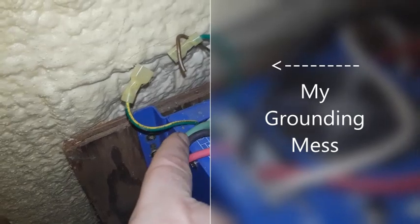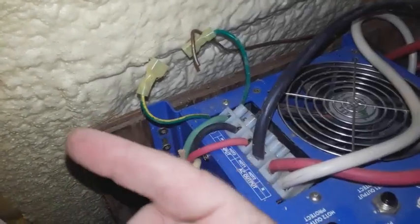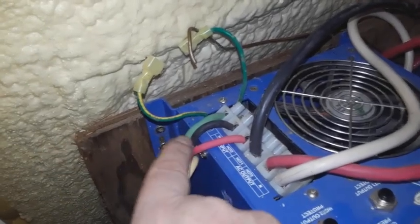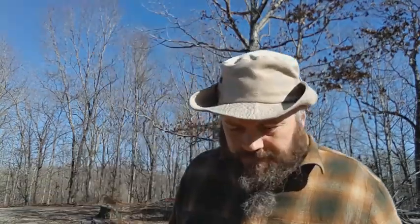And what this ground does specifically is handle the power outside, whatever that may be, and that happens to be the generator. So now we have a ground situation. If there's a fault, the ground goes back to the generator. This is why I have to go look at the generator to see how it's bonded or unbonded.